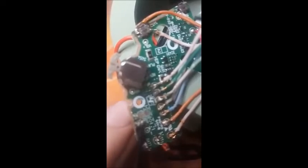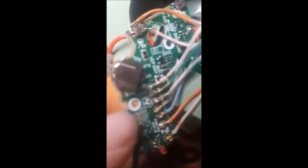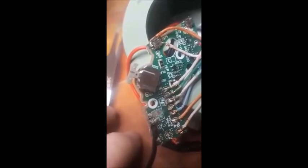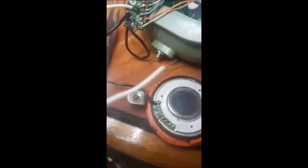Unfortunately the pad got torn off and everything was placed together. So I've scratched back the top part of the PCB and got a little more area to solder onto. Now it's all soldered on and I've got to do the speaker side, using something longer and a lot more forgiving in flexibility.